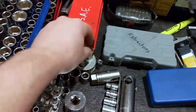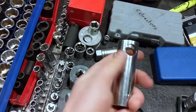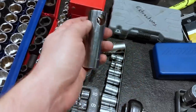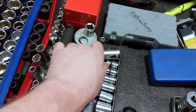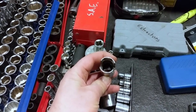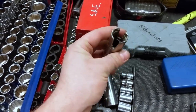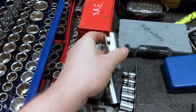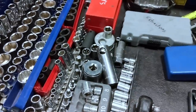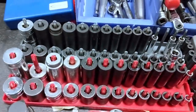This is a stud driver, and so is this one — there are some wedge pieces in there you can stick in to grip the stud and it works fairly well once you figure it out. This one I made for taking the wing nuts out of the battery box on Kenworths — I just stick it on the end of my impact or power ratchet and zing them out. Got tired of using pliers and thought there had to be a better way.